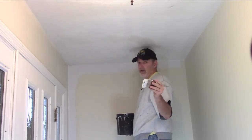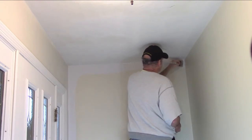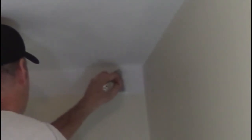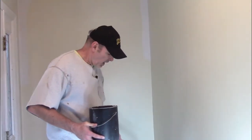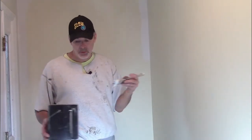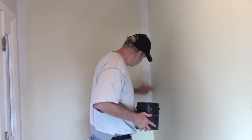When you're cutting in, you always work dry to wet. I started over here and I'm working this way — always dry to wet — finishing in this corner. If I'm working by myself I generally do one wall at a time. If you're working with a partner, one person can cut in and the other can come behind and roll at the same time. But this is a small space with really only room for one person to work, so that's me today.